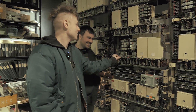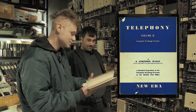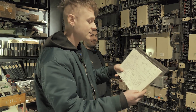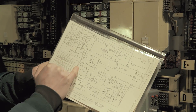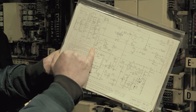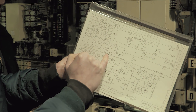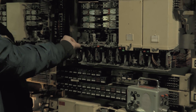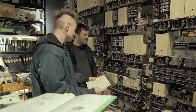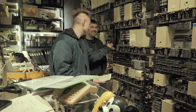What we're not sure about is: you pull it out, you just pop it to the side — just leave it like that. However, in Telephony Volume 2 it says you should move the U-link to points 7 and 8, which are underneath. What points 7 and 8 does — looking at the schematic again — is it takes the P wire, which is usually connected via the B relay, and actually connects it to Earth. So you're taking the P wire, disconnecting it from battery and plugging it into Earth. Maybe it's just safer — or maybe people were too lazy to do it. I reckon safer is the standard protocol.